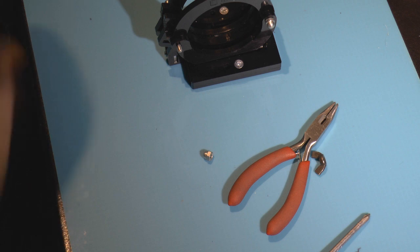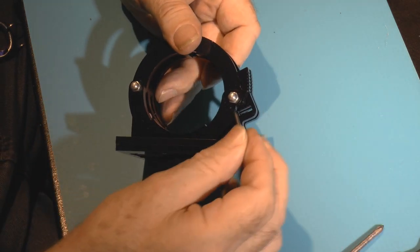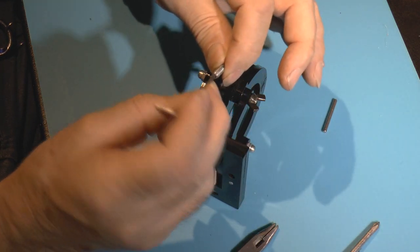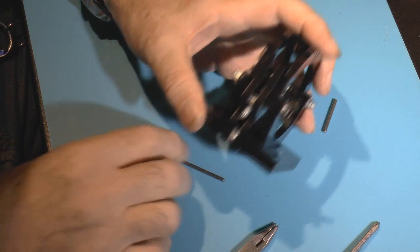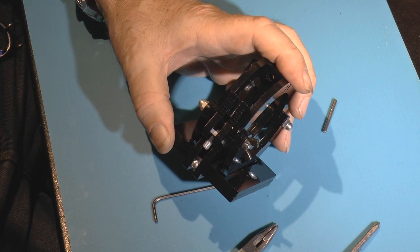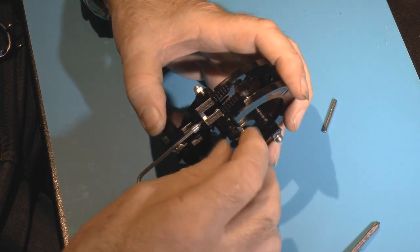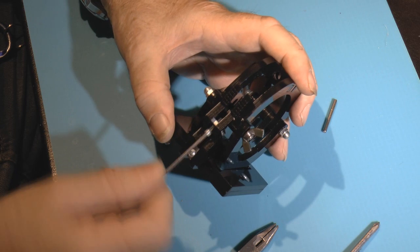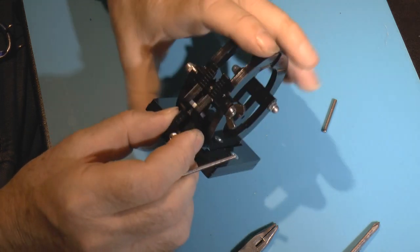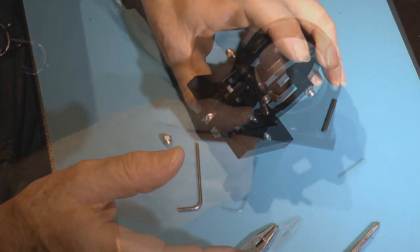Take one of the nuts off and replace it with a wing nut. Just below that nut there's another slot for another square nut, so I'm putting in another 16 millimeter grub screw. The little beaky bird bits line up with slots on this outside face — there are seven slots, six positions, plus or minus three millimeters. Loosen off the grub screw and wing nut, and wind it up so the birdie bits sit on the central slot. There's no spring mechanism — the weight of the unit holds it in position, and it looks neater without springs.